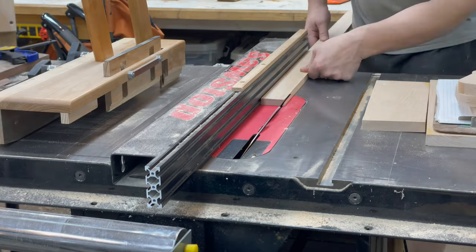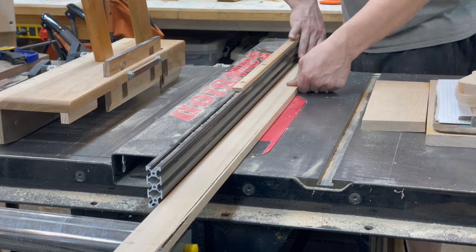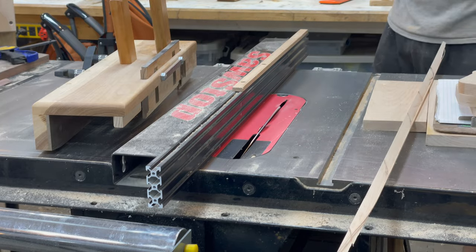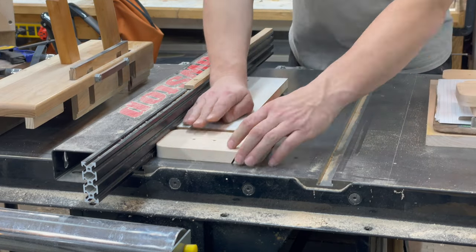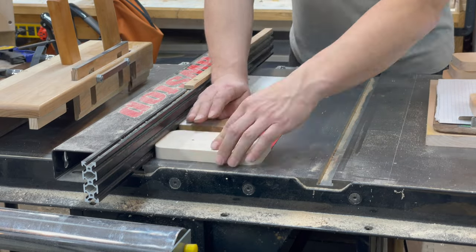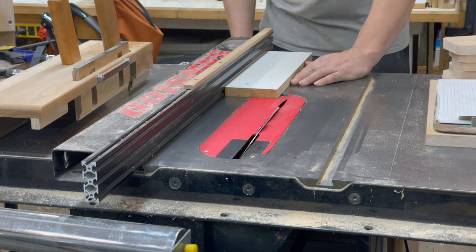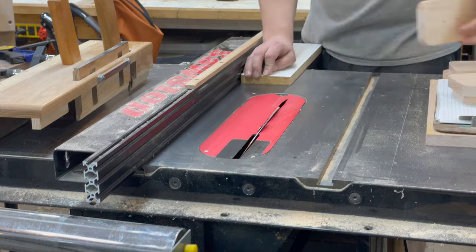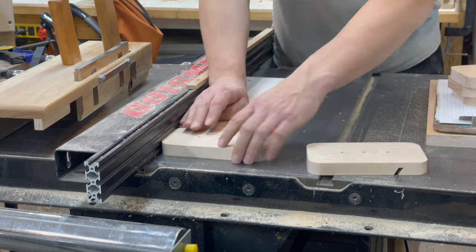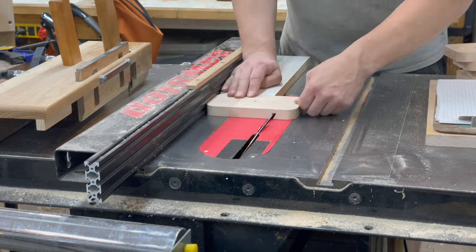With the plaque constructed, I'll now work on the wall mount. First thing is to make a strip to mount on the wall. I'm cutting a 30-degree kerf into the wall plaque. Instead of using a dado blade to speed this up, I'll be making a lot of small cuts. I find this provides less tear out and is not that hard to clean up afterwards.